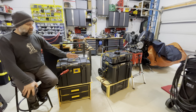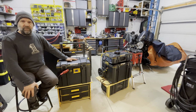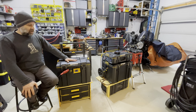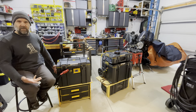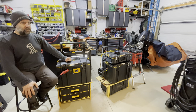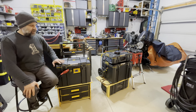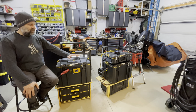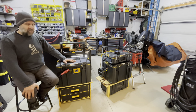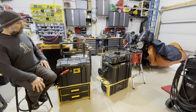The nice thing is the case will still look good for those many decades. If something new and improved comes out for cells, you don't have to start all over — the same wiring and BMS components carry over. Not having a sealed container allows you to service, repair, and update it. We have fuses and breakers inside. The bulk of the top layer of this battery is the BMS — the ElectroDacus, as I've talked about in previous builds.